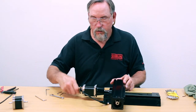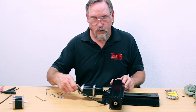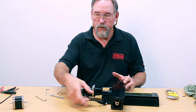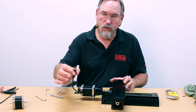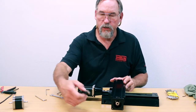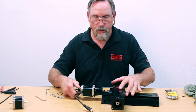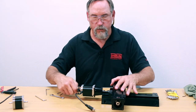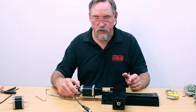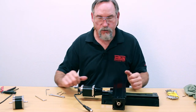Move it through a couple of inches to make sure it all feels good and you're ready to go. When you're turning this by hand, make sure it is unplugged. This acts as a generator and will generate electricity back to the cord, possibly blowing the fuse in your driver. So make sure it's unplugged whenever you're playing around with it. Then hook it up and actually jog it back and forth and make sure it all sounds good — no bad hums or anything — and you're good to go.